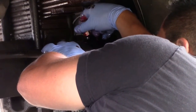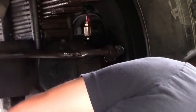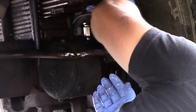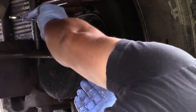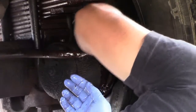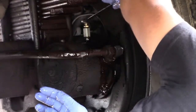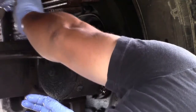From here I'm installing the new bleeder screw to bleed the line better. It's easy — you just let the engine run, and then loosen the bleeder bolt and let it run until there are no bubbles on the line. That's it. Just make sure the container of the brake pump is not empty, or you'll lose all your brakes.